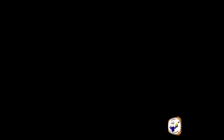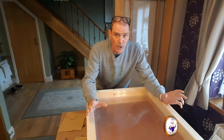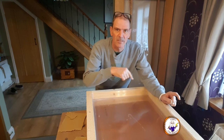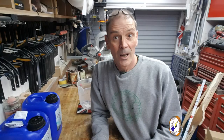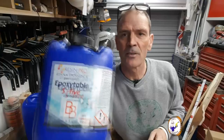Now in the dining room — this is where I start getting nervous. What I've got to do first is mix up just a little bit of resin to float on the bottom. This should serve a couple of purposes: first, it will make sure the bottom is actually sealed, and also if I mix up enough I want to coat my pieces of pretend live edge wood, which hopefully will minimize the bubbles. The resin I'm using for this project is Resin Pro — I've used it before and it was really good. I'll use up my old stuff first and then use a new batch for the rest.